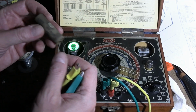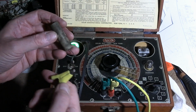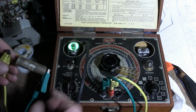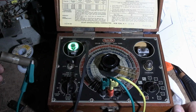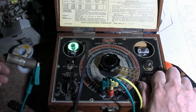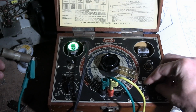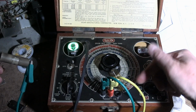And how about this big guy, 0.1, 600 in this special material. Let's connect it, and it should be good for all the way up to... Oh yeah, well, no, that's leaky at 300. That's crazy leaky at 500. And as far as capacitance goes, yeah, it's showing a short.